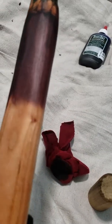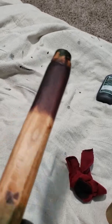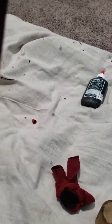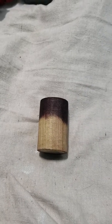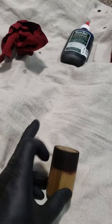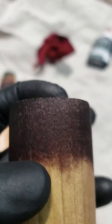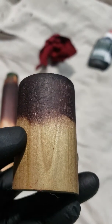I put the straight dye on the rag right on the wood and then I smooth it out till it has the same tone all the way around. Same thing with the poplar — put some on the rag and start from one spot, just keep smoothing it. I go back and forth and then side to side to get it into all those areas, because this is a really heavy grain. Still didn't get it all but that's okay — it'll help with the effect later. Now we're gonna do some blue just to see what happens.